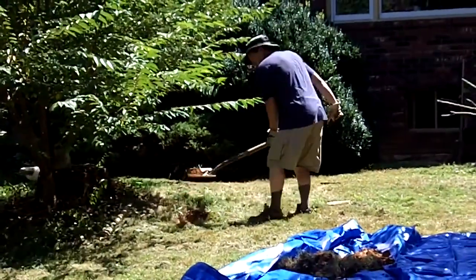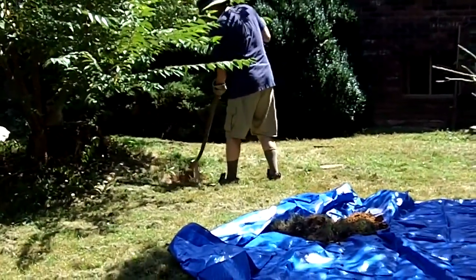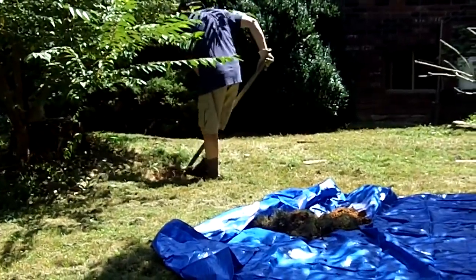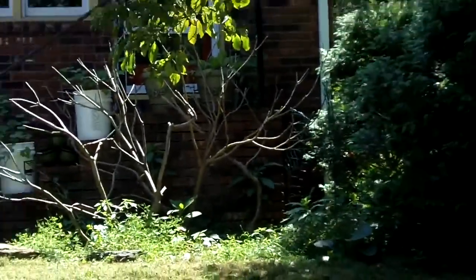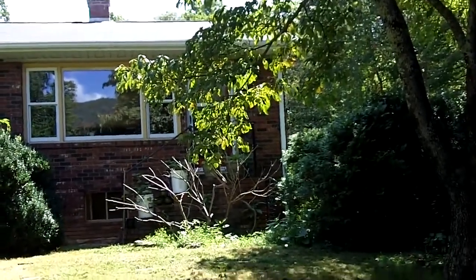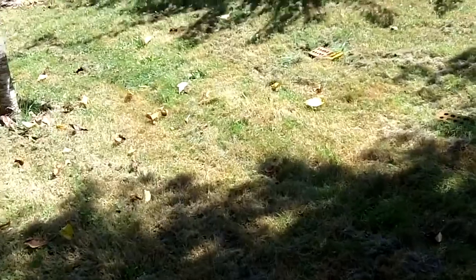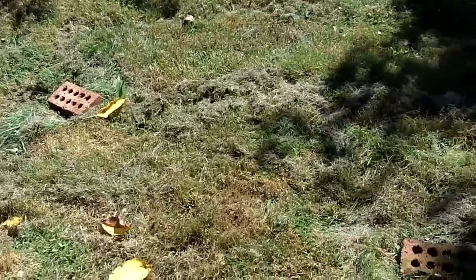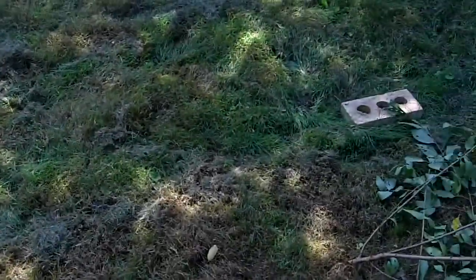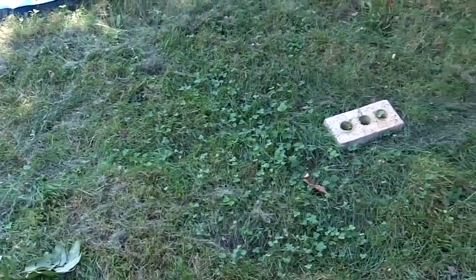Sorry for my zigzagging. We're beginning to dig our very first swale trench that we've ever dug in our life. The goal is going to be to dig a swale going across here, connect it with water from the roof. We'll start to fill that swale and then have it come down, and also measured contour down here. What you see as we come in closer is there's some bricks laying along the ground - these are all measurements of contour on our front yard.